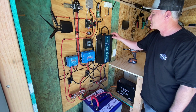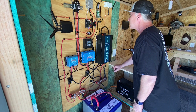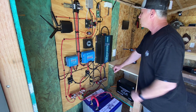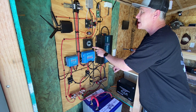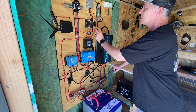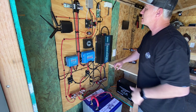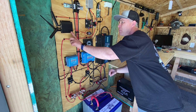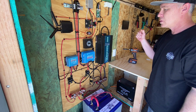Let's turn the inverter on and see if I get power from the batteries. Yes — I'm at 26.5 volts and 120 volts AC, which is lining right up with the battery monitor. Let's go ahead and turn on the electronic components and do the 24 to 12 volt step-down. Yes, I am getting power — the Raspberry Pi is getting power, the Pepwave wireless internet is getting power, and my shed lights turned on. That is perfect.